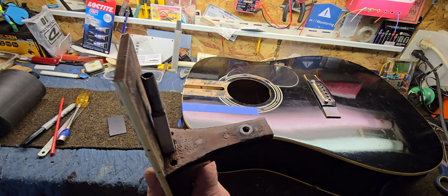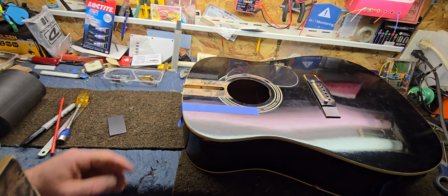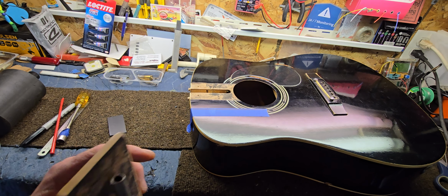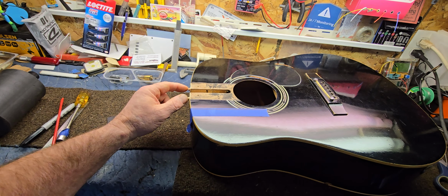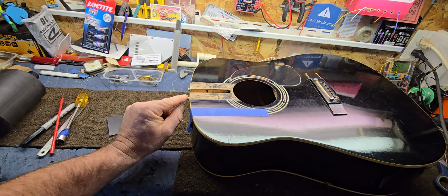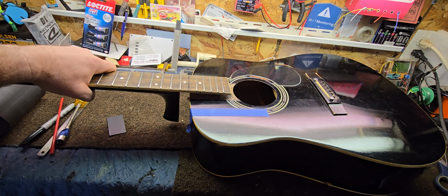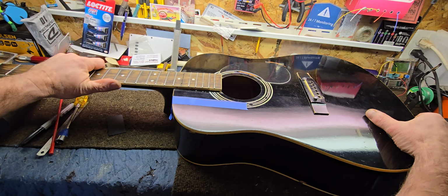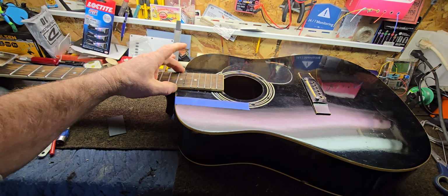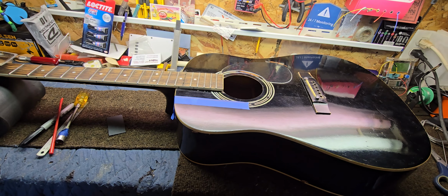All right, so what we ended up doing here was putting an anchor in the heel. Okay, that come out good. It's nice and solid. It's in there strong. And I took the dowels that we cut off, those little nubs, and I plugged these holes up just for strength purposes. And I left a little bit on these two top ones, maybe 1/4 of an inch sticking out, and I kind of rounded them with sandpaper on the ends. I figured I could use those for alignment purposes. I knew I'd always have the option to cut them back off, but as it turns out, it works really well. And it does give it a little bit of extra strength on this kind of weak point, if you will. So that's basically how it works. And once you get that in there, you stick your bolt back in.